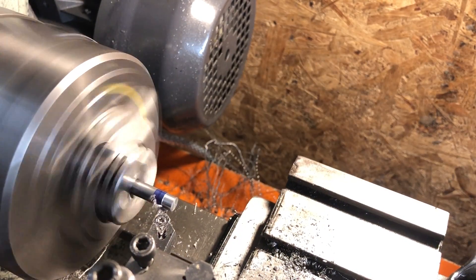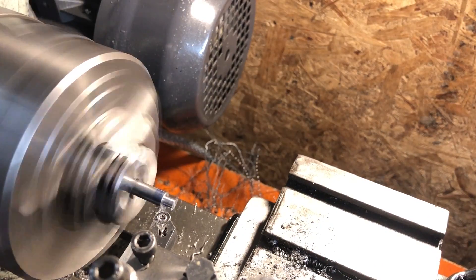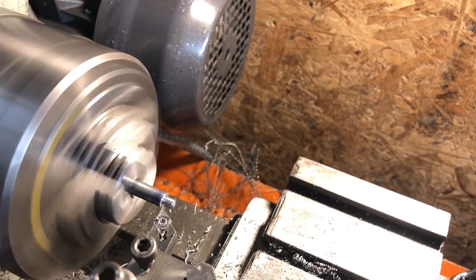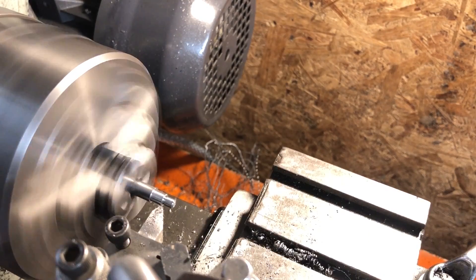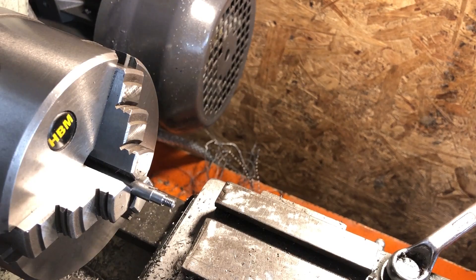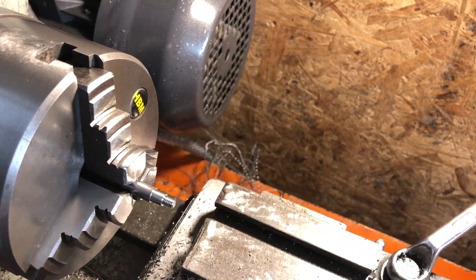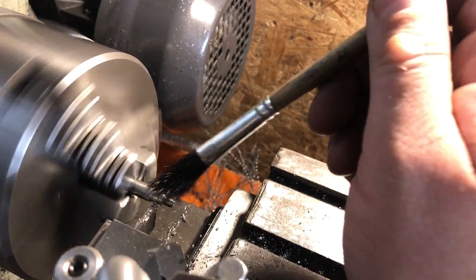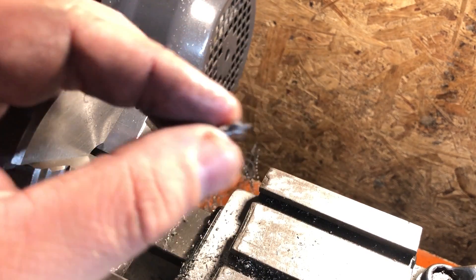I'm extending the work and dialing in the length using the top slide to part this off. Moving on to the screw, I'm setting the shoulder depth with a carriage stop and turning down to 4mm for the thread, before adding a small runoff groove and a couple of chamfers. Next is the dimension for the head, which should have been done before swapping out to the chamfer tool, but what can you do? I'm forming the thread under power using a die in the tailstock, starting with the die fully open and adjusting the size until I have a nice fit on an M4 nut. The length looks good so I can part this off, and after an honest 5 minutes of searching in the swarf tray the part can be put aside for slotting later.